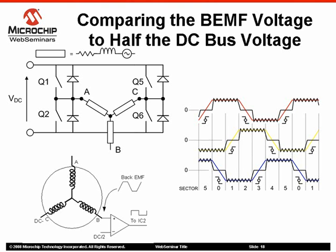This circuitry is easy to implement with three operational amplifiers configured as comparators. The drawbacks of this method are: it assumes that the motor winding parameters are identical, the sensed back EMF signals have positive and negative phase shifts, and motor rated voltage is less than the VDC voltage most of the time. Therefore, the zero crossing event does not always occur at VDC divided by 2.